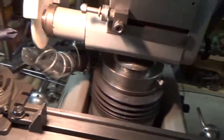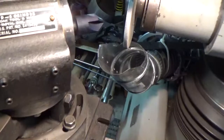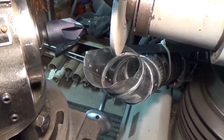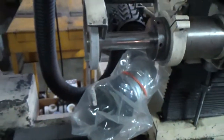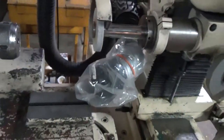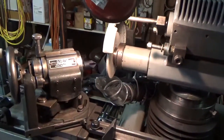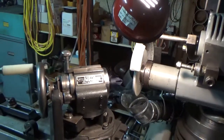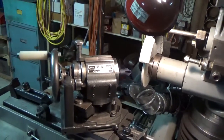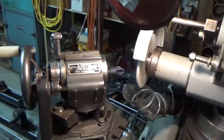I'm going to turn on the dust collection system, which you can see underneath the grinding wheel on the number two, and also over here on the Monoset which I've got blocked off right now. When we resume filming, my wife Vida is going to be doing the filming so I can have both hands free to operate the tool and cutter grinders. We will then show the relief grinding on the fixture.